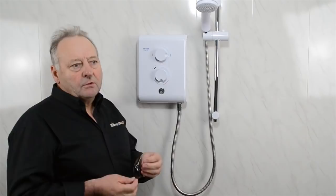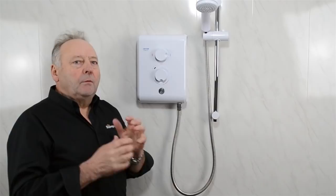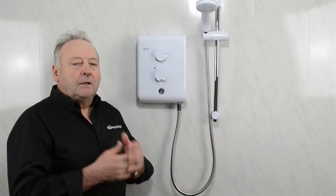One of the things we're going to look at today is the elements in the heating tank. The elements can often just burn out because of old age and various reasons, so it's quite a common fault to have to replace the heating tank. What we need to do first is test the element to make sure it's actually faulty.